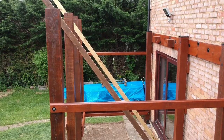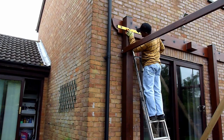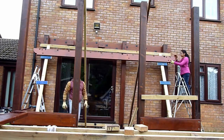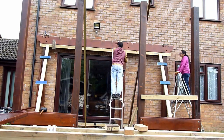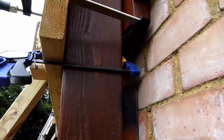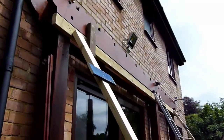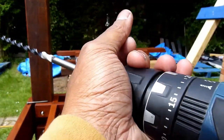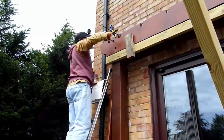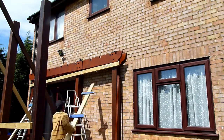The next step is to put the next girder onto the rear posts. I'm marking off a line parallel to the rearmost girder so I can attach a sacrificial 2x4 post to hold the girder in place. Once done, I attached clamping blocks to hold the whole thing tightly so the girder sits flush with the posts. The next step is to drill pilot holes so we can drive in coach screws to hold this girder tightly against the post. Once that's done, I removed the sacrificial 2x4 timber.